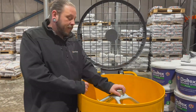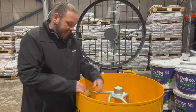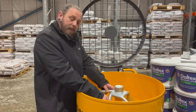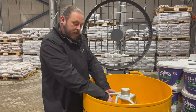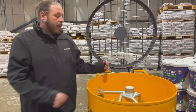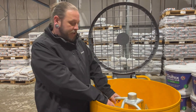With your Baron mixer, it's essential that you make sure the blades are free and easily moveable and set to the correct depth from the drum. This is because if a piece of gravel, aggregate, or whatever you're mixing gets stuck against the blade, this can cause the mixer to fail by blowing your main relay. This is one of the cheaper parts to replace, but if it can be avoided, we should do that.